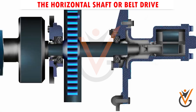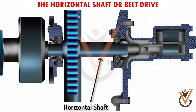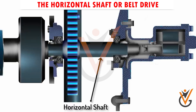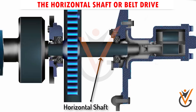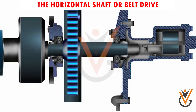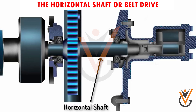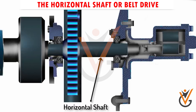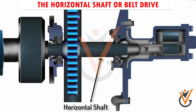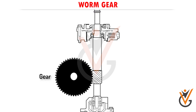The horizontal shaft or belt drive: the electrical motor drives the horizontal shaft through the clutch pads and is used for transmitting rotational motion to the bowl assembly. A special belt having elastic character is used in some models in place of the horizontal shaft, thus removing the use of the gear assembly. The horizontal shaft material is a special alloy of steel.